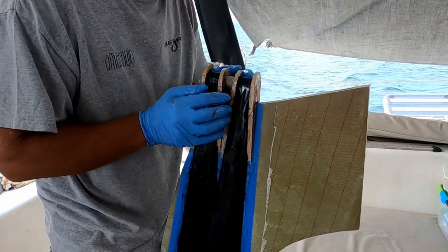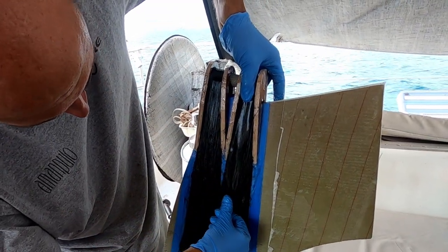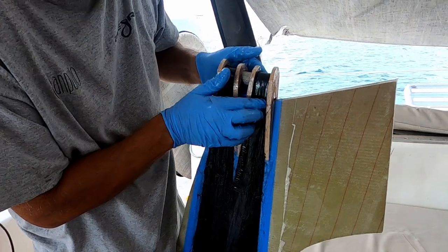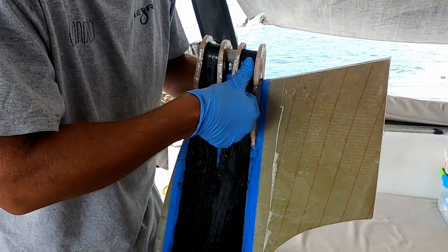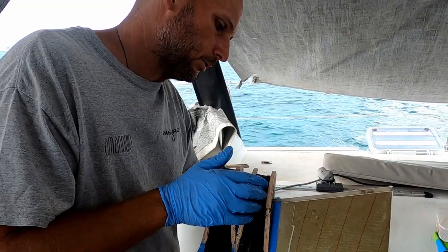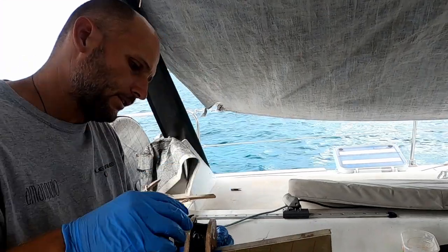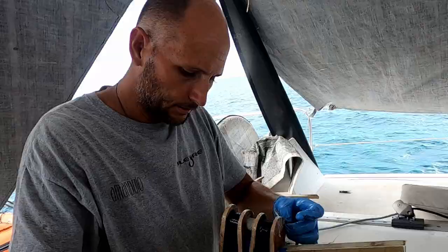And in terms of fanning it out once you put it on, how do you know where to put it? You just know where you want the loads to go? So I have a plus and minus 5 degree splay on this, which is sort of the minimum I look to try and do with this style of chain plate. This allows for some off axis loading of the chain plate.